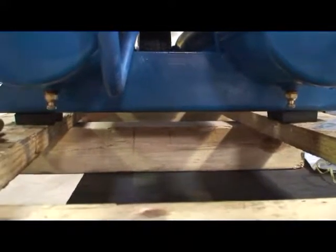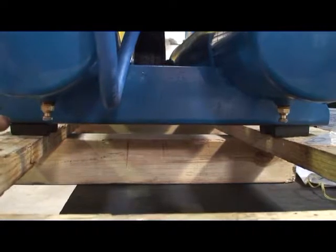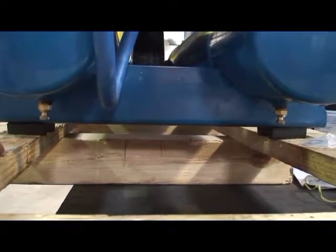They need to be drained on a nightly basis after this machine is run for the course of the day to evacuate the contents of the drains and get any available moisture out of them.